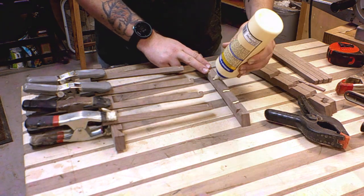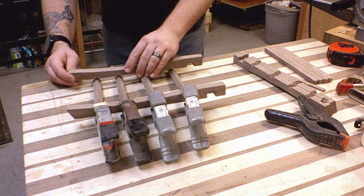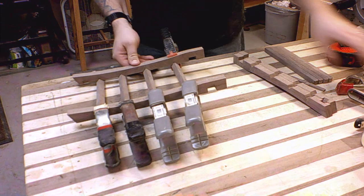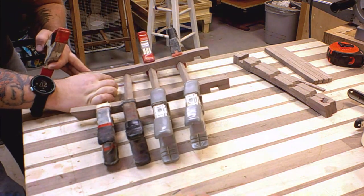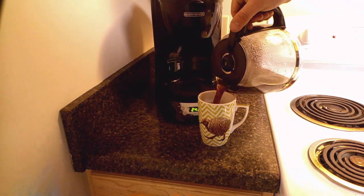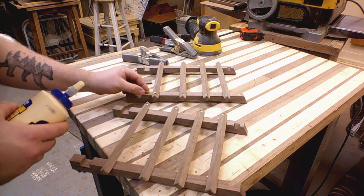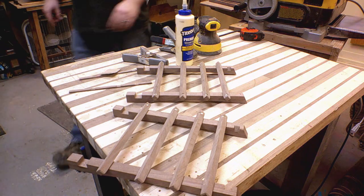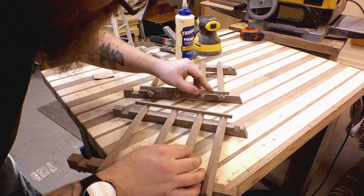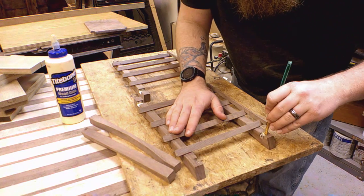It's time to start assembling the case. I'll start by gluing in the diamond drawer guides into their corresponding notches in the legs. I am careful to line up the drawer guides so they are proud of the legs on both sides by 7/16th of an inch. Now I'll glue in the back vertical supports, and then it's on to the main case assembly.